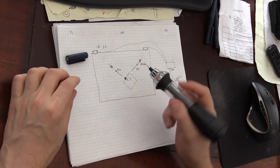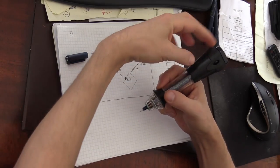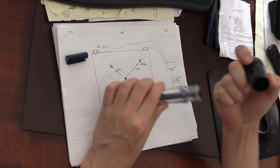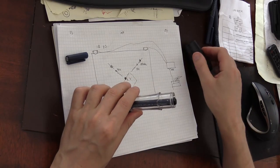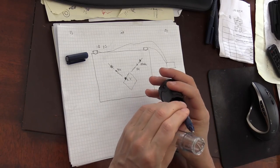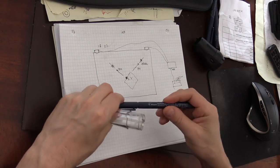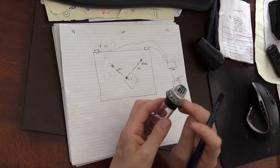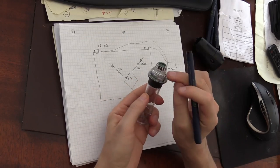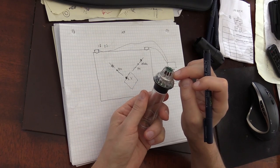So as I write on a board like this, I'm pushing on the pen, and by pushing on it, I press the button that is located at the bottom of this container. You can see down there are several buttons. Obviously, this is all designed for the whiteboard pen, which has a bigger diameter, and that's what's going to be pushing on the buttons down there. So what happens next is that this head has two transmitters. There are four infrared diodes and a single circular ultrasound transmitter.